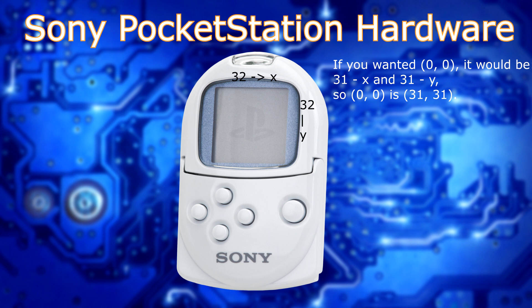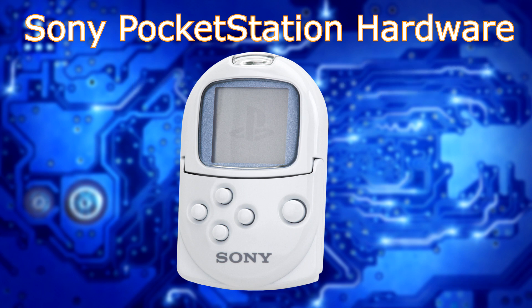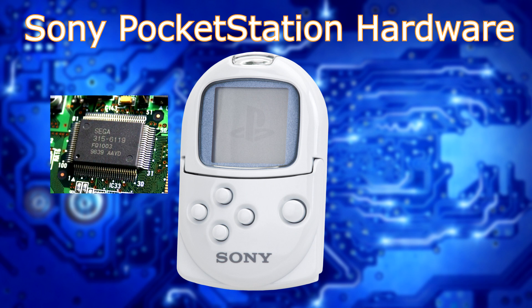With typical bit manipulations this is usually not the case, however, so a subtraction by 31 needs to be performed. So if we wanted to set the 0th bit, or position 0,0, we would actually set position 31 in both the X and the Y. This 32-bit processor was more than overkill for just flipping bits. Processing and sending these bits to the screen would have only consumed about 5% of the CPU's resources — even with writing every single pixel of the screen, and with clever programming, you could probably get that down even further.